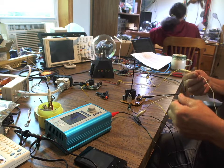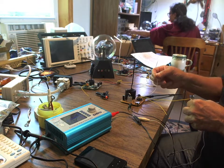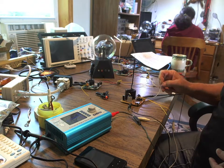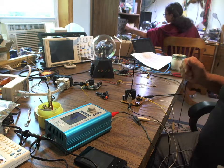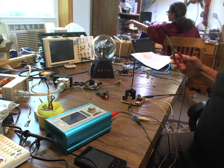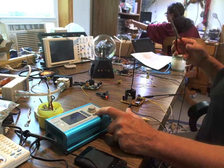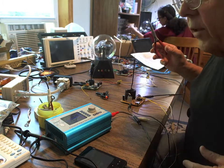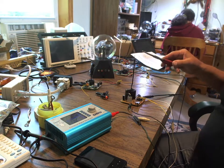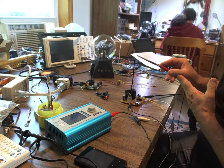I have the Spooky connected to channel one. The master controller board automatically ties the gating line high, so I don't have to connect it if I'm not going to use gating. For this example I'll bypass that. I have a pair of metal pliers here. I turn my Spooky on — it's set for 30,000 Hz — and I should be getting about 20,000 volts coming off the top of that transformer wire. I can see it when I get it close — there it is.